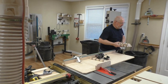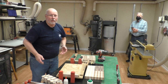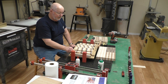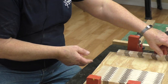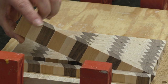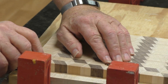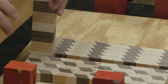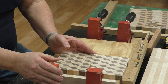Then it's back over to my cutting board jig. I typically run about a three-foot long board and don't like to go more than four feet because it gets too hard to handle. Here are the pieces I just cut. We're going to turn them on edge. Now you can see how everything is lined up — the walnut's going this direction, the cherry's going this direction. What we're going to do is take every other one, flip it and turn it — and there we have that 3D pattern.